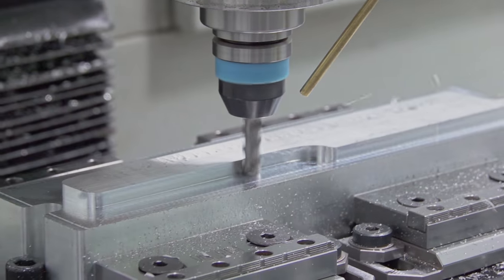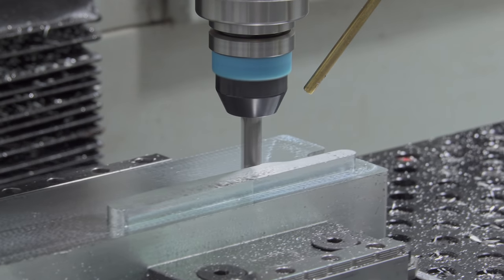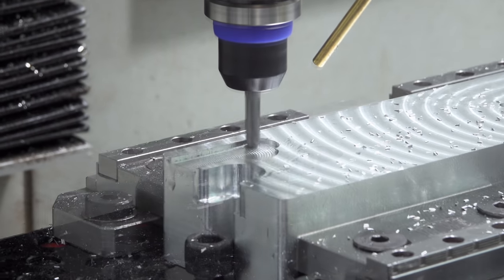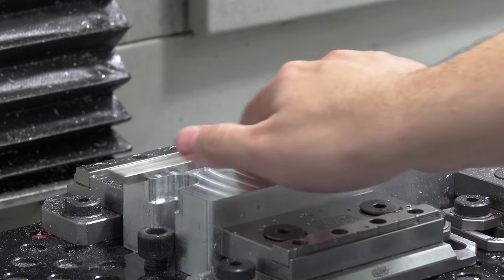This fixture will have all three operations to make the handles, and I leave a small island for the third operation. Next, I mill a pocket to hold bar stock, and some deeper pockets to hold some Mitee-Bite pitbulls. This replaces doing the first operation in a vise.